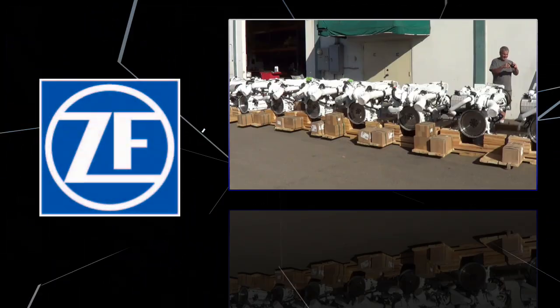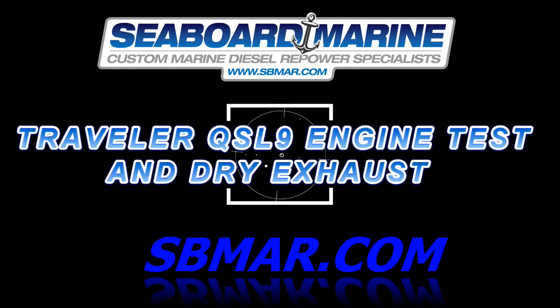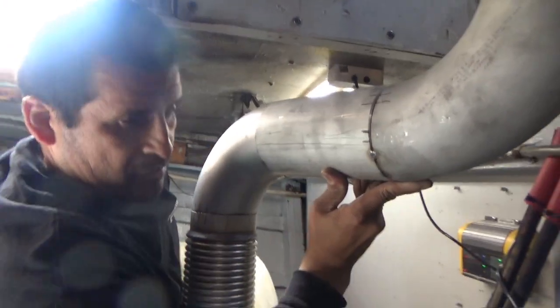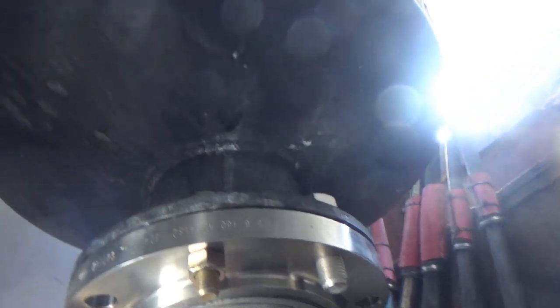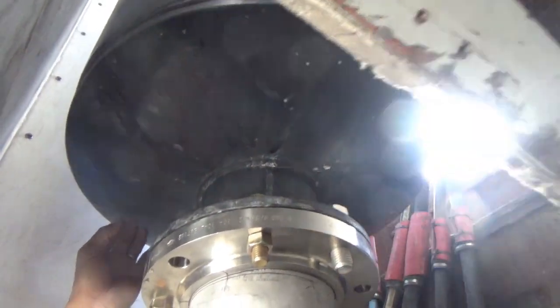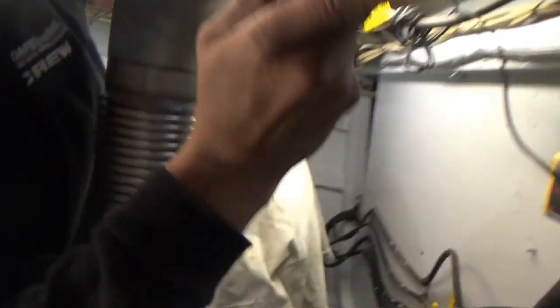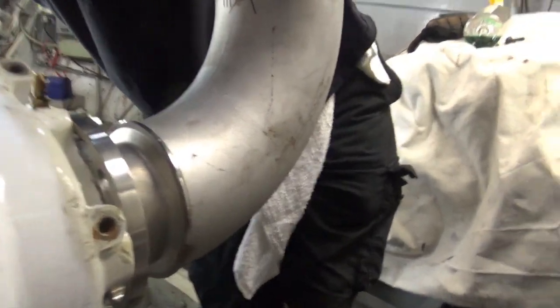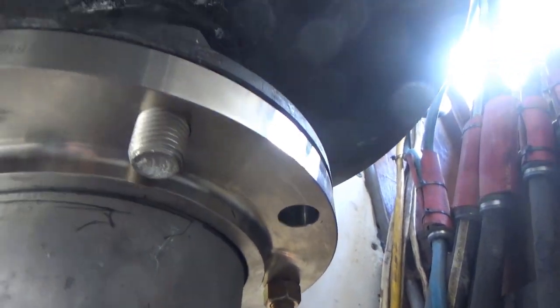What are we doing today, Frank? We are mocking up and welding an exhaust for the Traveler. The dry exhaust? Yep. See this thing right here? That's the muffler, and this is all the dry exhaust down to the turbo. So we got it all tacked up and mocked up. Bolting up to a QSL. You've just been going back and forth to the boatyard, tacking all this and getting it together here, and then we just marked this because we're going to weld that in place.